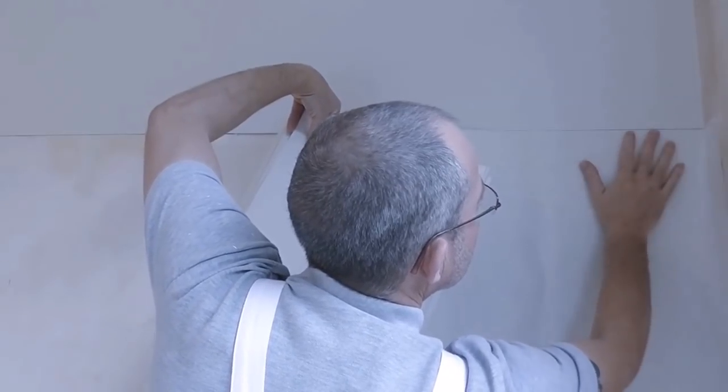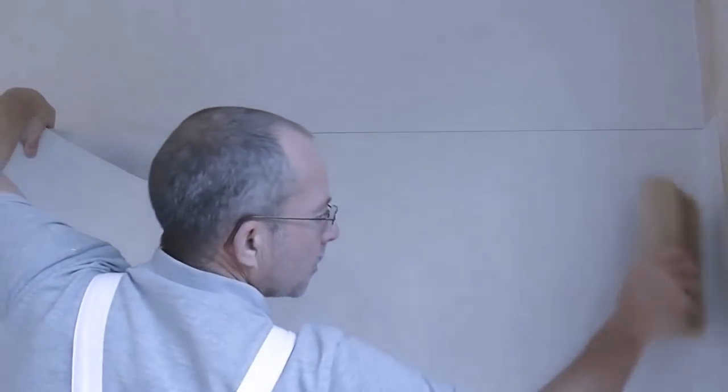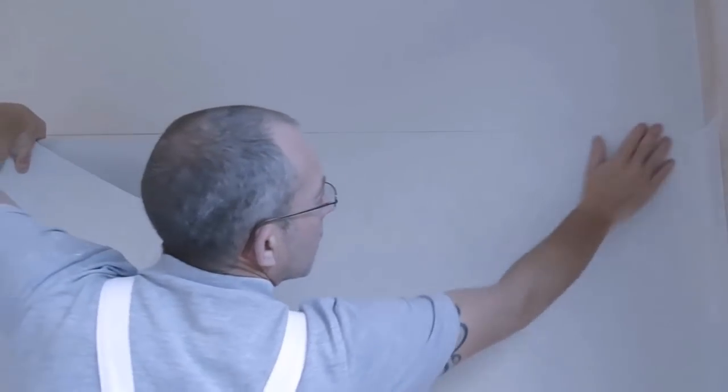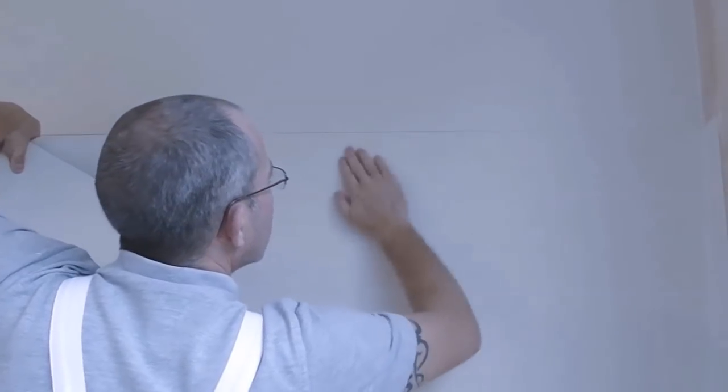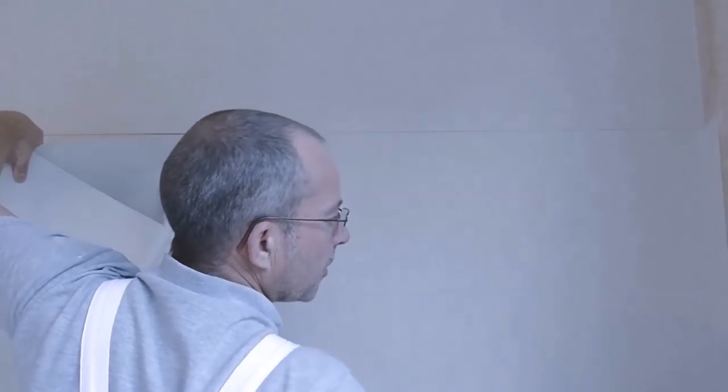Now, releasing your first fold, making sure you've got your overlap around the wall, I say 4 to 5 inches, and then follow the line along, let out another fold, and then you don't have to butt it up straight away, because you can spread it out a little bit, and then push it up to your line. You don't want it overlapping at all, and you can check that by feeling with your fingers. It wants to be nicely butted up, but not overlapped, and you don't have to push it up against it. So basically that's how you put your piece on. Then repeat that process down the wall.